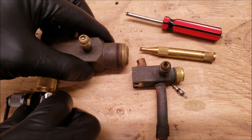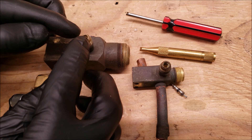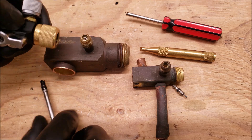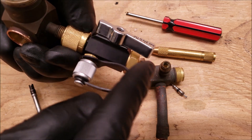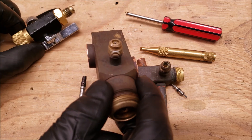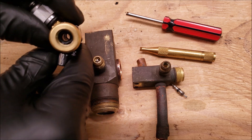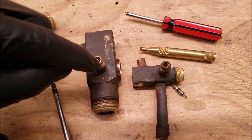After you're done disconnecting the hoses and if there is pressure inside the system, you want to go ahead and put bubble leak detector either on this port where the valve core is, or you could use this valve core removal tool — take the back side out, screw it right onto here, and essentially what you've created is a tube that connects here. Then you can just put bubble leak detector in the end and see if it bubbles out. Either way, you're going to need to blow the bubble leak detector out of either the port or the end of this when you're all said and done.